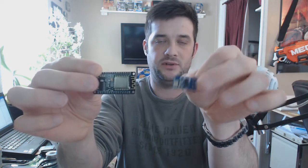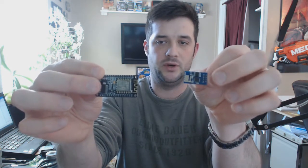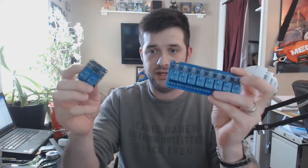The ESP8266 — this one's a number 12E, and this one's a 01, it's the very first one. Now, the benefit of these is you can control relays. The 01 is like $1-$2 shipped and can control a double relay. So making a homebrew Alexa-controlled outlet, you slap it in one of these little project boxes and build this all into there.